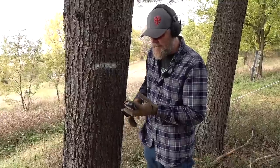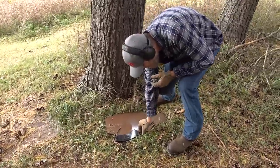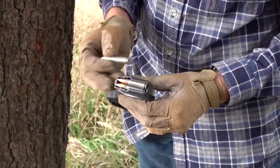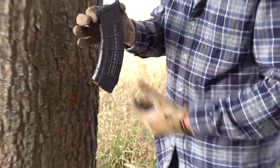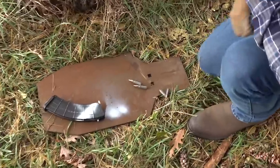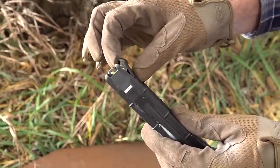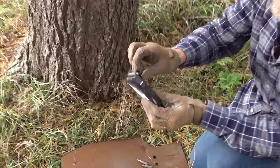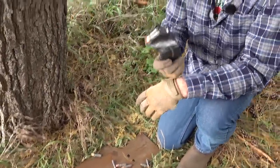Now four drops for the AC Unity onto the steel plate, feed-lips-first. Holding from the top at chest height: that one dropped a round out of the magazine on impact - hit more square. I don't see physical damage to the feed lips but it did drop a round. Second drop: dropped a bunch of rounds - one, two, three, four rounds out, one sticking out - and it cracked the magazine. This magazine is no longer serviceable. It took just two drops onto the steel plate feed-lips-first to completely destroy this magazine.